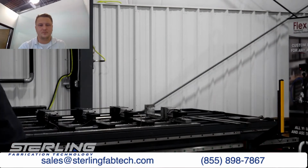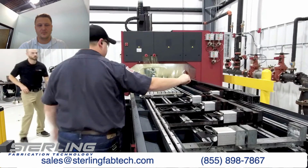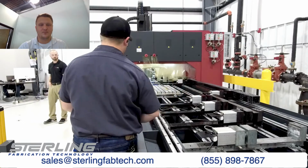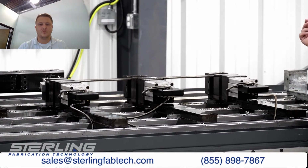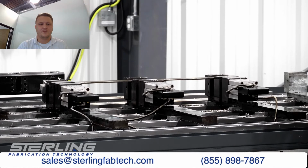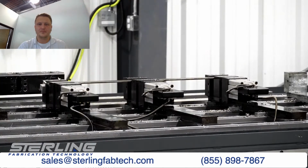Over here I'm going to move the monitor over a little bit. On these 3 pneumatic vices, we have a 1/4 inch by 2 inch flat bar, about 36 inches long. Again, we're going to drill some smaller holes. We're getting some 1/8 inch holes, another 27/64 hole, and then we're going to put a 1 inch by 3 inch long slot right in the center. And again, I'm going to utilize that high feed mill so you can really see the speed that comes with that tool. There you go, good deal.